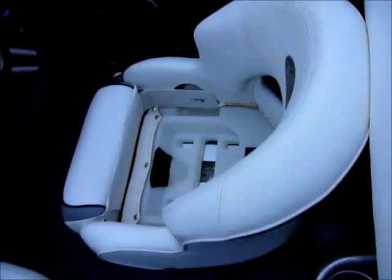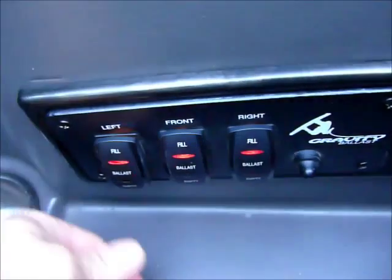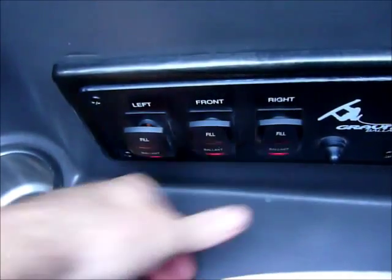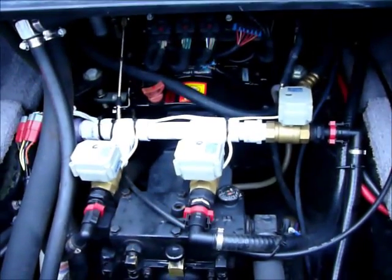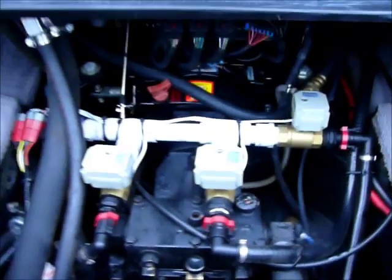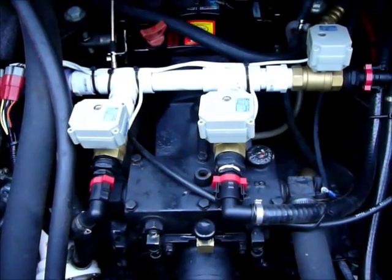My control system for this boat is just a series of switches — I have fill, then off, then empty. I basically couldn't keep a clean wake before because I was filling one ballast and draining another, or not filling them at all — it was a mess. This new system drains and fills the tanks in about five minutes, slightly less than five minutes, compared to the 15 or 20 minutes it took before.